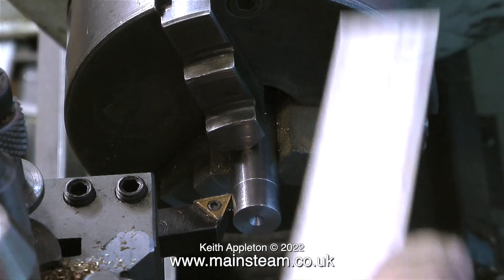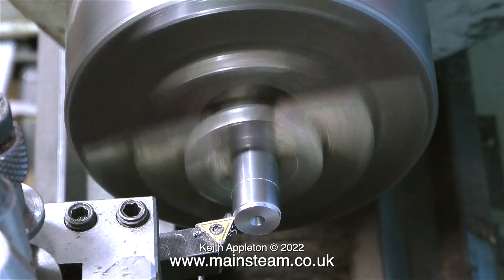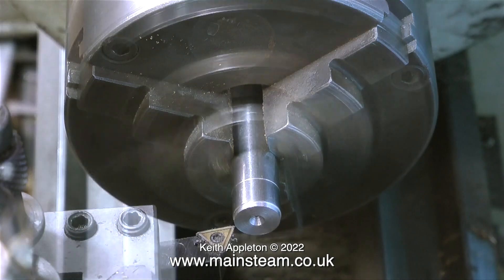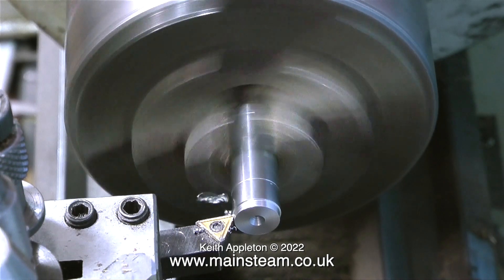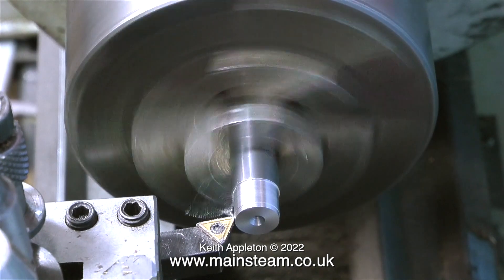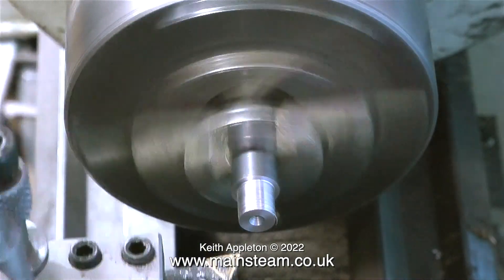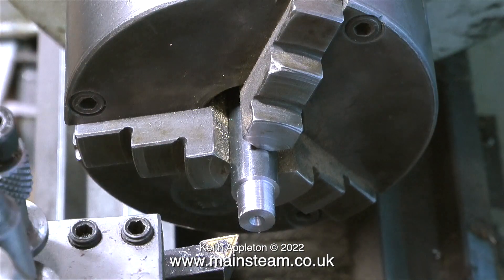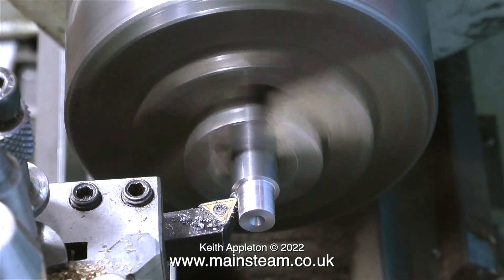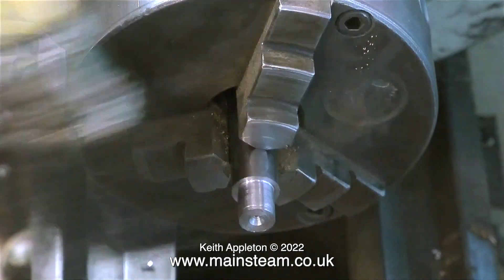I've marked the position of three-eighths of an inch down from the end of the shaft and I'm making a mark with the tool, giving me a line up to which I'm going to cut. Here goes the first cut — I'm not taking too much off. I check I haven't taken too much off to start with, and of course I haven't, so I continue down to the line removing a little metal at a time. Some people watching will be cringing, but I keep telling you I'm not an engineer — that's why it's good for beginners to watch this.